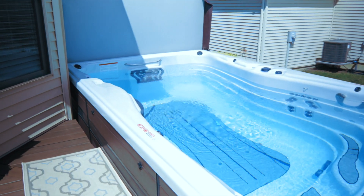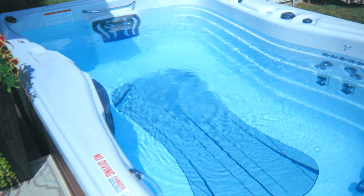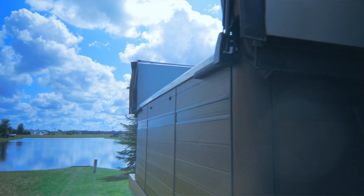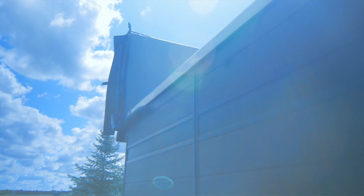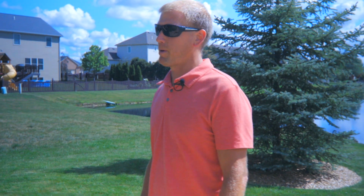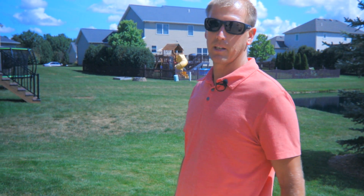I watched one of the Master Spas videos and they recommended a two-foot above grade, which kind of makes it part of your entertaining area as opposed to an area that people stay away from. When I was designing the deck, I used the Master Spas information for the weights — the weight of the swim spa itself, the weight full of water, and designed it for six to eight people. So roughly I was looking at about 22,000 pounds that the deck needed to carry.